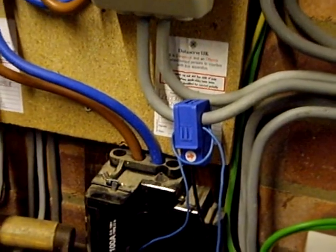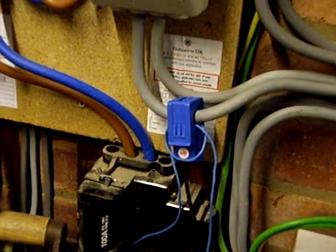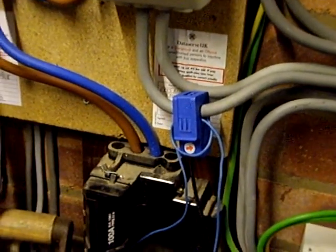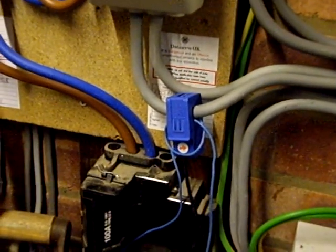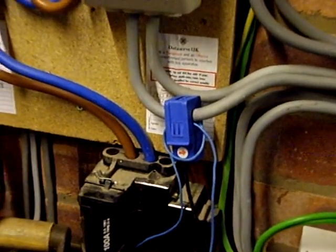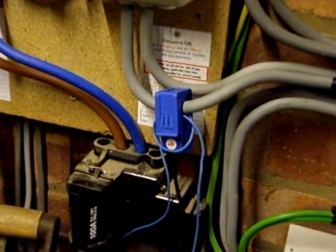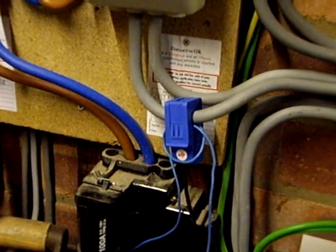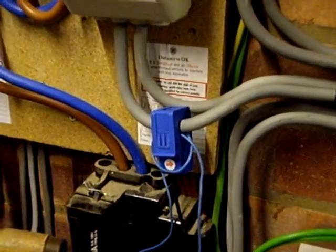The CT sees the difference between the power coming in on the big wire and the power going out essentially twice. So if I put a kilowatt of power on in my house, it looks like a kilowatt of surplus PV is being generated. This allows you to check that the system's working, although you're diverting power that you're paying for rather than free power — but that's fairly straightforward.